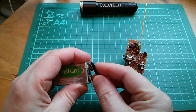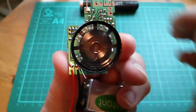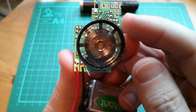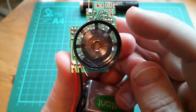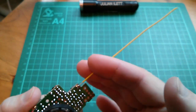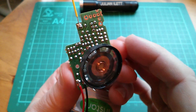Let's attach the 9 volt battery to the walkie-talkie board. There's no sound coming out of the speaker because link J1 isn't fitted — I will fit that immediately after I've done this. I have attached a little piece of wire antenna for when I transmit.